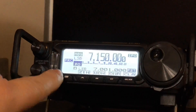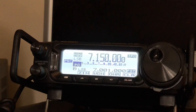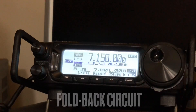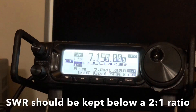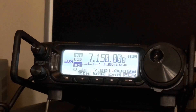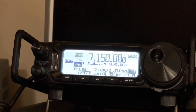If that's not happening and you're not getting a blinking light indicating you're out of bounds, then there are two things that could happen. One is you're transmitting into a high SWR — I'm not, I'm on a dummy load. What will happen is the radio has foldback circuitry and it'll start lowering your power output to try to protect the final output transistors that produce that 100 watts. But if the SWR is really really bad and the antenna isn't matched close enough that the radio can even deal with it, at some point you can damage the final output transistors in the transceiver and it would have to go in for repair. Fortunately Yaesu provides a three-year warranty on these, but if they detect that you've been abusing it they would likely void that.